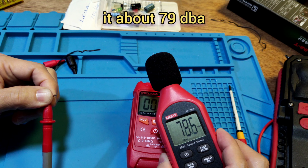And so the bigger one. It's so 41.6 meg. Bigger. It's so 61.6 or 7, because this meter's range is 0 to 60 megaohm. The bigger may not work. And this meter has a hold key. Press this one to hold the reading. And long press again may turn the backlight on, and backlight off. And they have a top function.